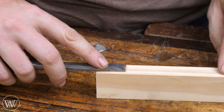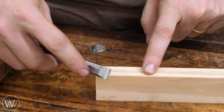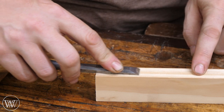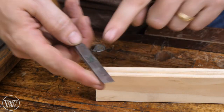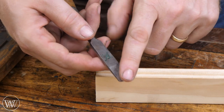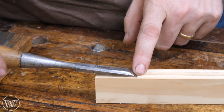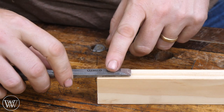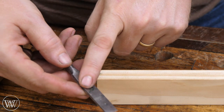The reason you don't put a back bevel on a chisel is surface referencing. If I'm referencing the flat back of the chisel and there's a high spot, I want the blade to connect with it and shave it off flush. If I put a back bevel on there, I have to lift the handle to engage the iron, which causes me to rotate down into the wood rather than cutting a flat surface. So you never want to do that with a chisel.